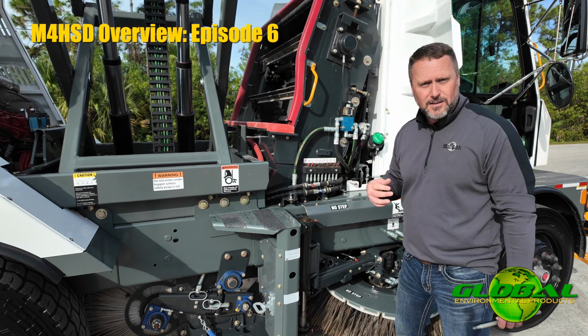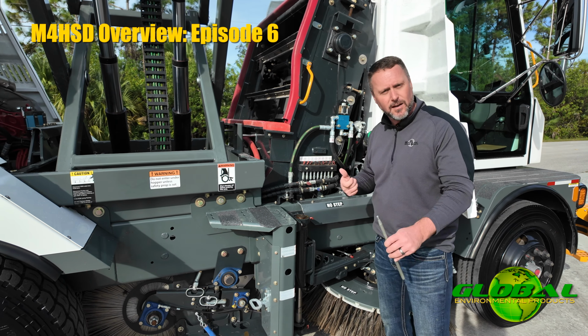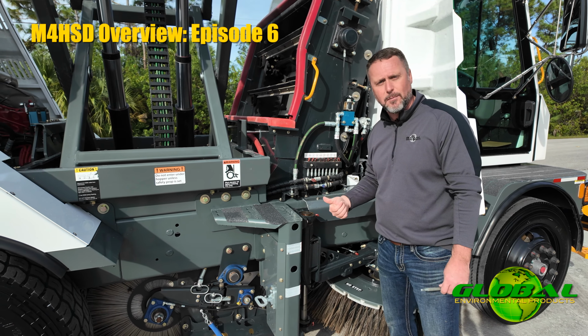And I like that, because then I know every day that operator is going to flip this panel open, he's going to put a grease gun on those zerks, he's going to give it a shot or two of grease, and we're going to know right away if that zerk took grease or not, okay? So it eliminates a lot of those problems on those high moving parts.